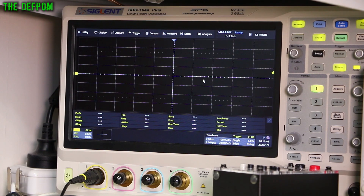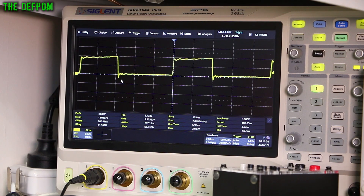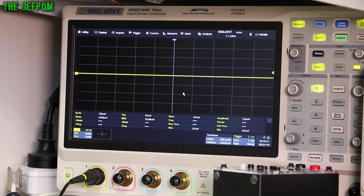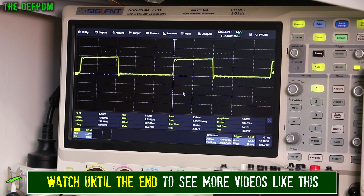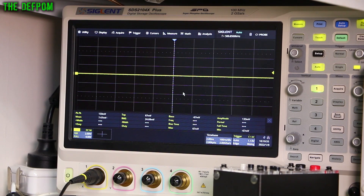I've now changed over to move the short onto TP705 and I'm now probing on TP701 instead. That looks the same — that's fine. I'm not going to wait for it to start beeping. That looks good. I've now changed the setup. I've put a little grabber on IC707 pin 8 to ground that pin out, as per the instructions, and then measuring TP702 for the waveform again. It looks the same — that's fine.